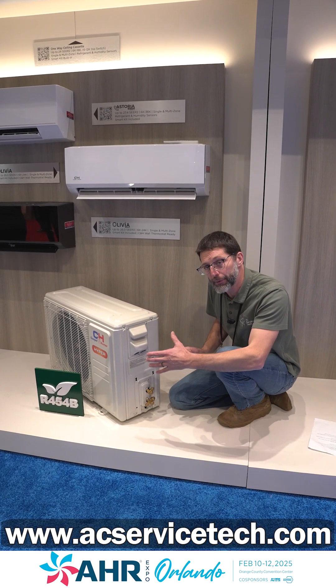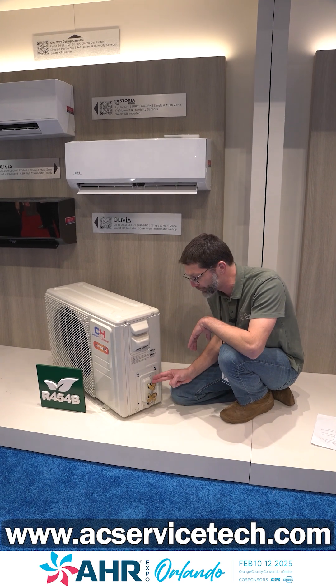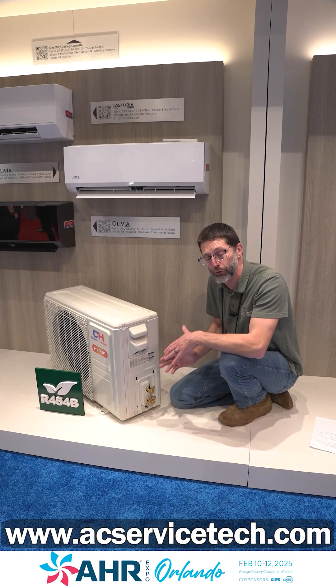New outdoor units from 6,000 BTUs to 12,000 BTUs all have the same line set sizes — from quarter inch to three-eighths as an outside tube diameter — so that's ACR copper tubing.